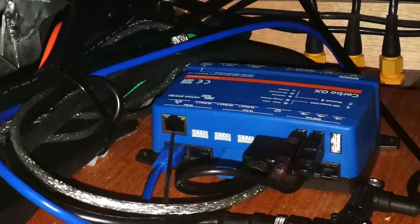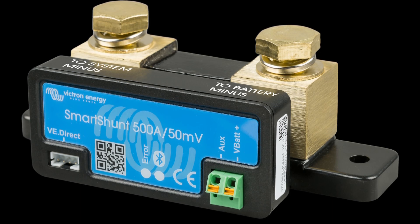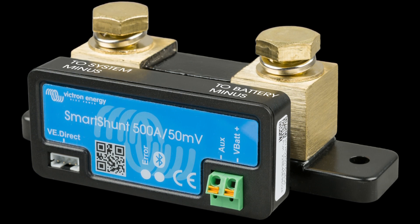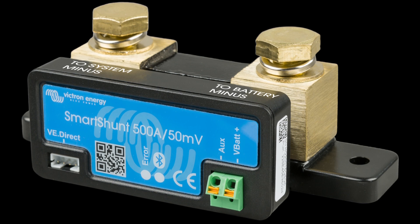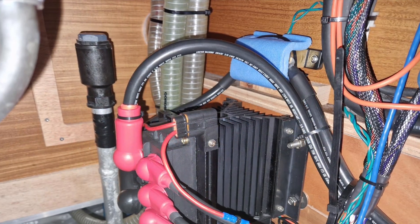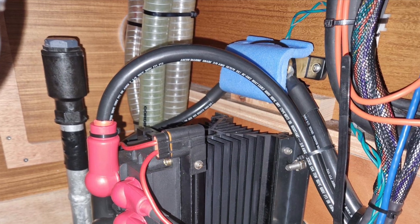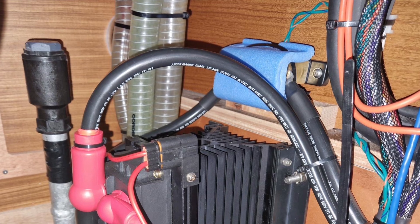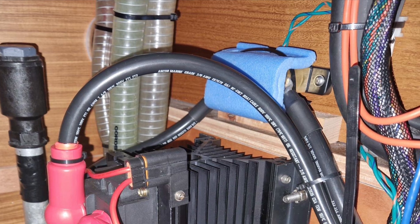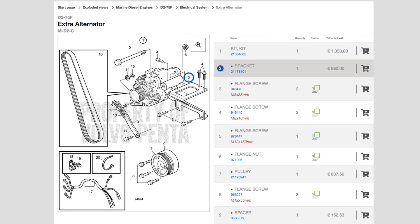Here's the Cerbo installed up at the nav desk — at top left you can see the ethernet port with the other end of the cable plugged into it. What this means is that the Victron smart shunt can supply data about the system's voltage and current flows, so that information can be transmitted back to the Arco Zeus, which can then regulate the way it works according to how you've programmed it. There's also an additional shunt that Tom has installed on the alternator negative cable so that the Arco Zeus can monitor what the alternator itself is doing as part of the power generation process.